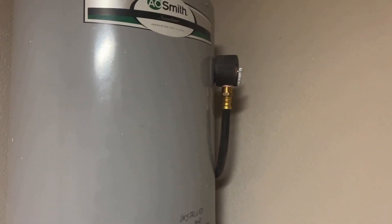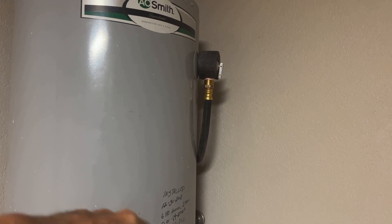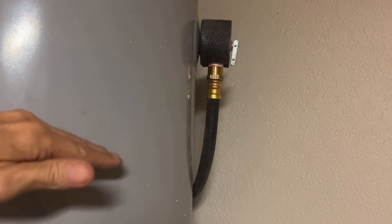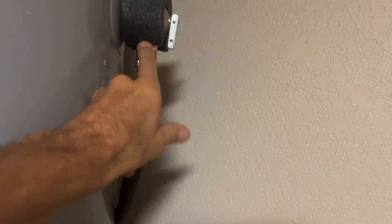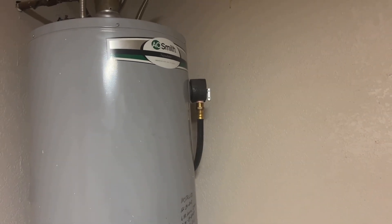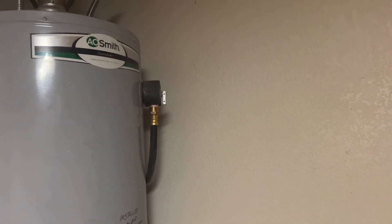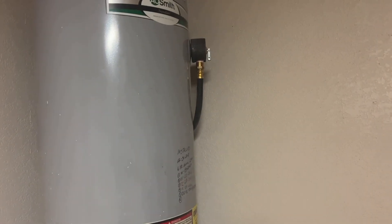In the future, when you drain and you open this up and find that it is leaking after you drained it, just follow that same process. Or you can pull it out and inspect it. Or better yet, open the valve up before you drain it, then close it, and see if it leaks. If it's leaking out to your line to the outside of the house, then you definitely want to get that replaced. But don't listen to someone that says never, ever open this up when draining your water heater. That's ridiculous. Open it up, make sure the thing works. And if it doesn't, invest $30 and you'll be all set and ready to go.